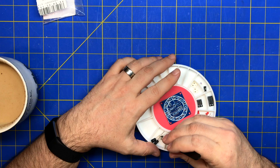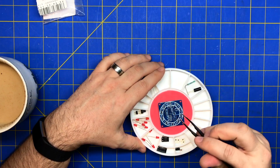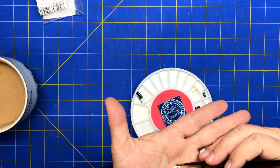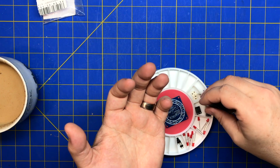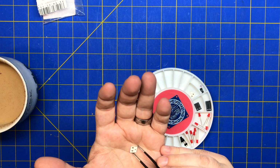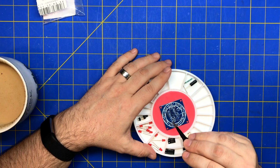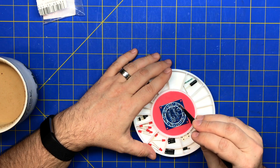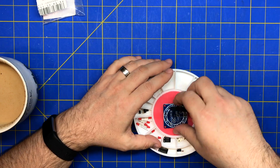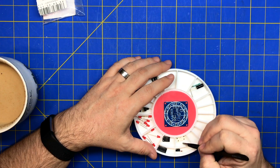Looks like we got two different values, 47 microfarad and 1 microfarad. And I guess they're going to go one. They're all labeled. It's a good idea. If you make a kit, make sure you label the silk screen. This is a 1003. And this is a 470? 474. Alright, so 470K there and there, 10K there and there. Right, 10K. Oh, I see one 10K on here. 470, 470, 10K. Yeah, looks like they gave you two, just because it's probably hard to cut one.